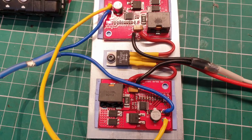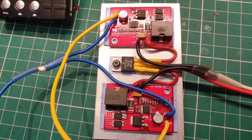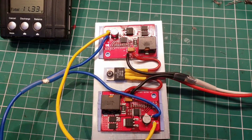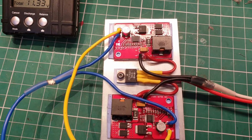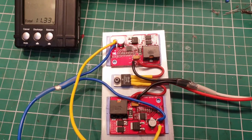They're kind of 12.8 volts rather than 12.6, so they're overcharging the cells a little bit hard. So putting a blocking diode in will drop their output by the voltage of the diode. It now drops them down to about 12.5 volts, which actually I think is quite acceptable. It basically means that the cells won't get overcharged.